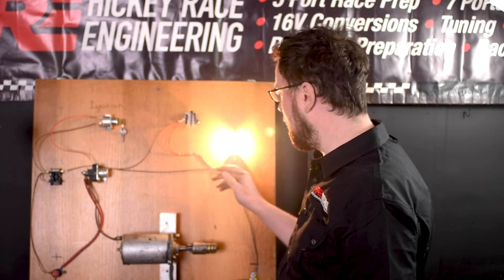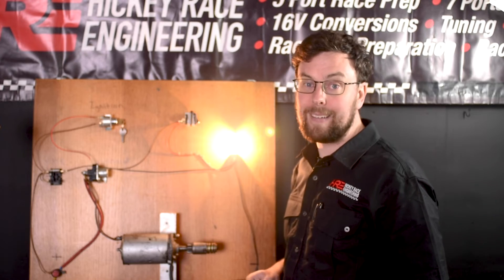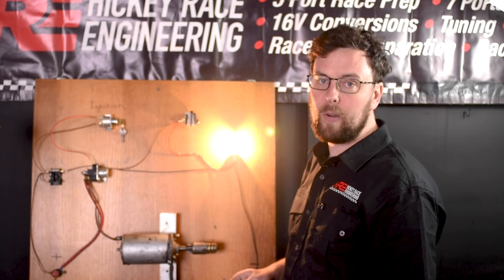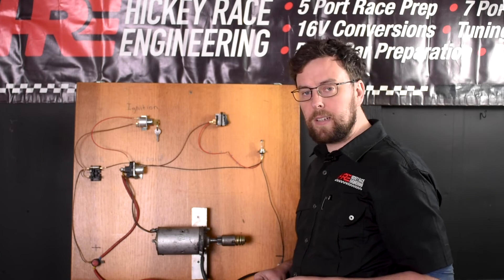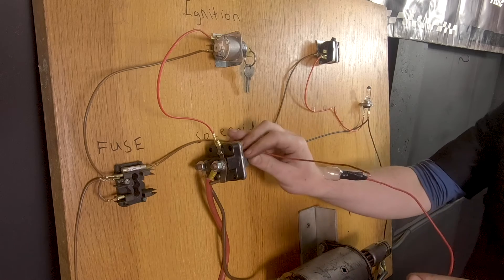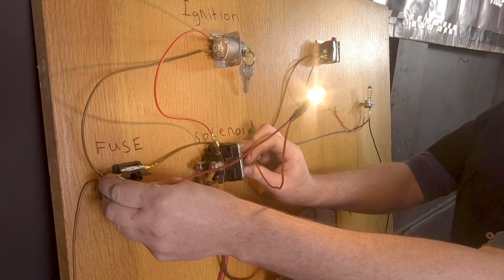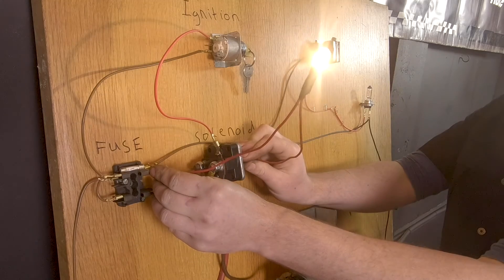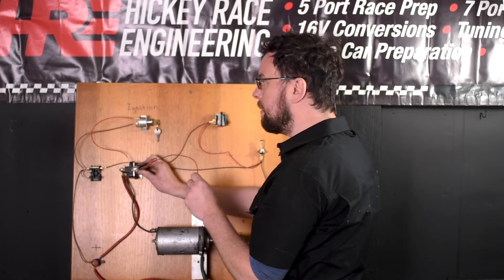I have another problem built in here — I've put a break in the cable — to give you another example of fault finding. We've repaired our fuse but the bulb is still not lighting, so let's keep on this fault finding mission. Let's check our work first: have we repaired the fuse? Our bulb is lighting on that side. Is it now lighting the other side of the fuse? It is. So we've repaired this fault, but there might still be a fault further on.